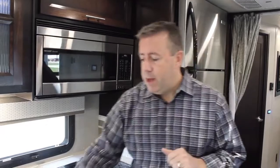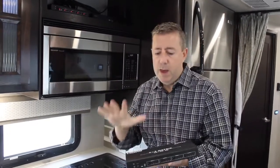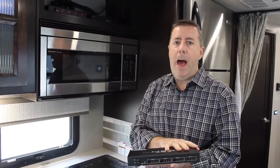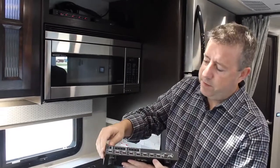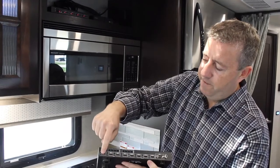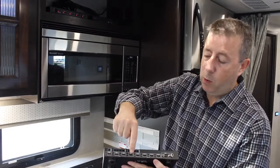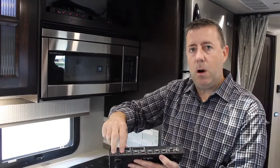In fact, the one I'm going to show you today was actually free. Because we can't see up into the cabinet where the matrix is, if your vehicle is equipped with a 4x4 matrix, this is what it is. It's basically really simple — four HDMI inputs in and four HDMI outputs. On the back side, you have input 1, 2, 3, and 4 — those are your sources. Typically we'll hook a Blu-ray or DVD player up to input 1, input 2 would be your satellite, and then 3 and 4 are blank.